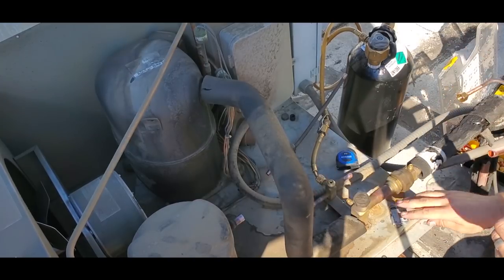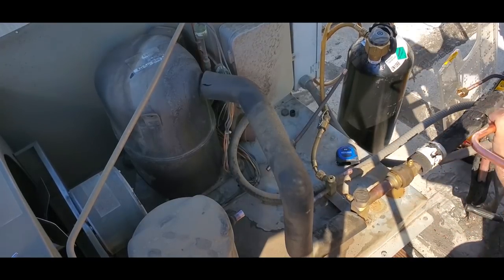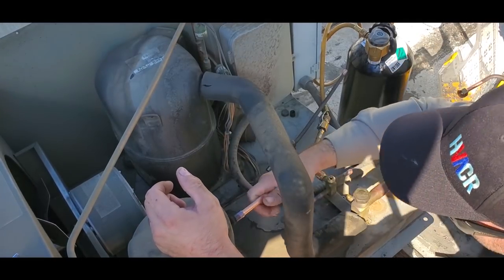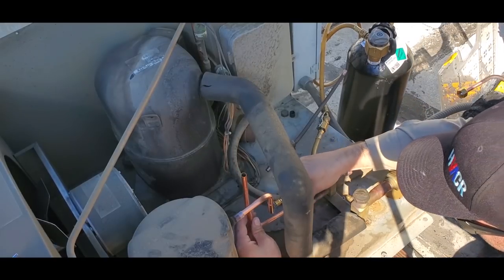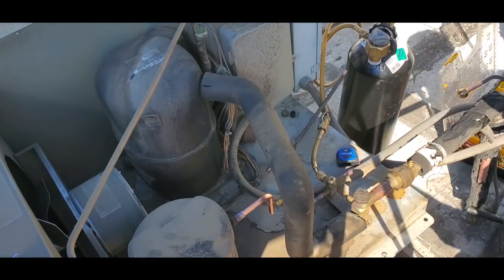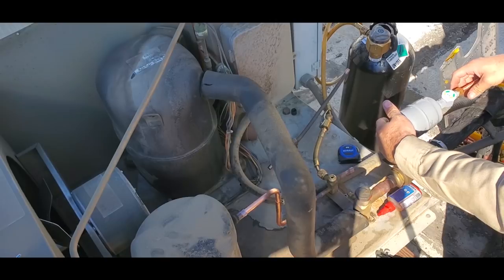This is actually going to get cut right down the middle, because I'm gonna put a 3/8 Schrader fitting there so I can see high side pressure in the system when we're pumping it down. There we go. And then that way, we can get a good pressure. Like that one right down there. This is gonna end up going here. I'm just gonna thread it on there by finger, and then,